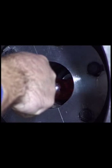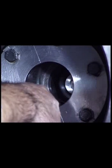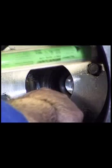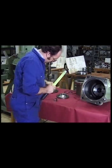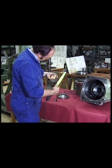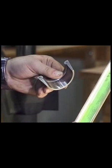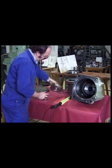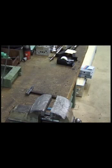The hydraulic piston must move freely and must not reveal scratches or score marks, otherwise the piston must be dismantled for inspection. Worn parts have to be either reconditioned or replaced. Also, these two cone pieces must be in good condition. On the air piston, the seal rings must be replaced at every valve overhaul.